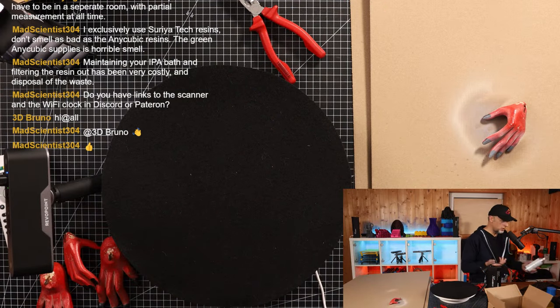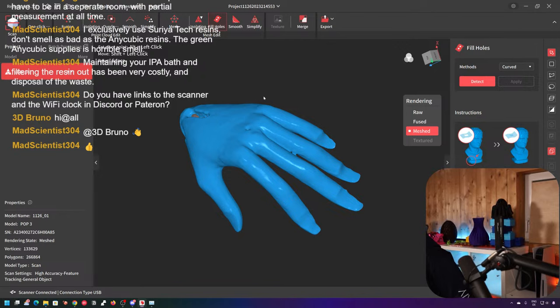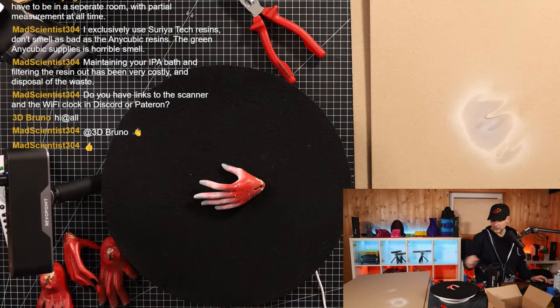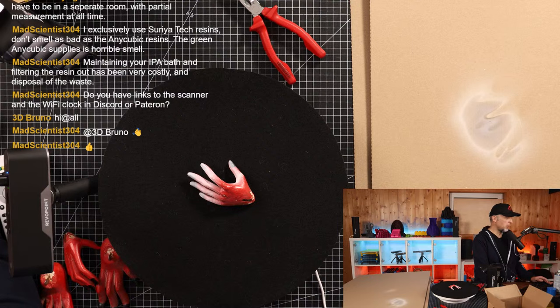And the only unfortunate thing about the scanning spray is it stinks a little bit. It's probably not really a huge issue. Let me see. I'm gonna go back to the scanning app. I'm gonna bring it back here, kind of show it again. Here you see. This is the scanning spray now, and the scanning spray covers the black stuff, and that's enough. So we can scan the black things, and it's going to disappear in probably 1 hour, and it stinks, but it's really good. It's very effective.